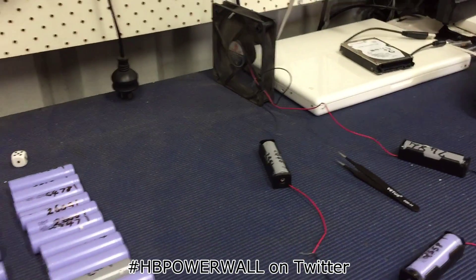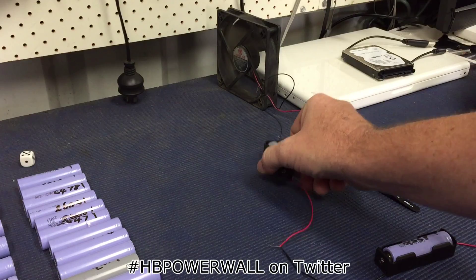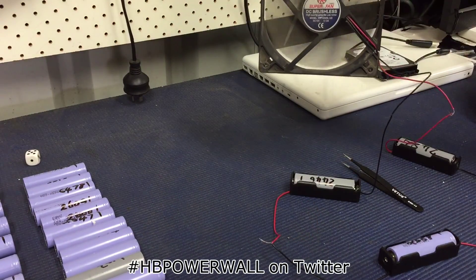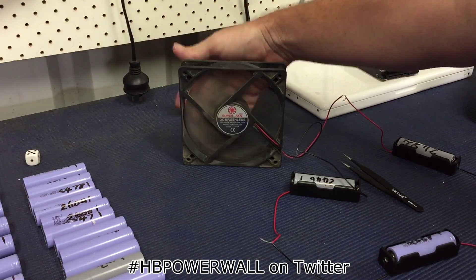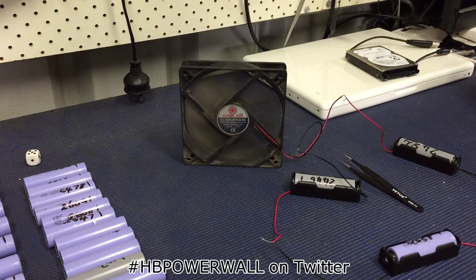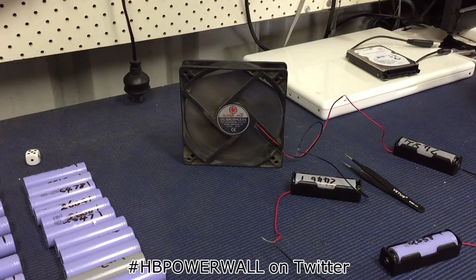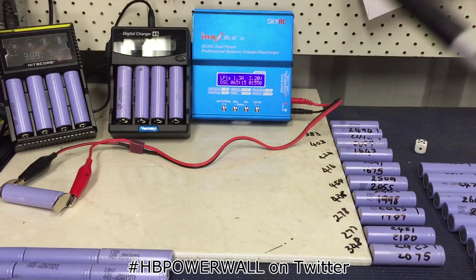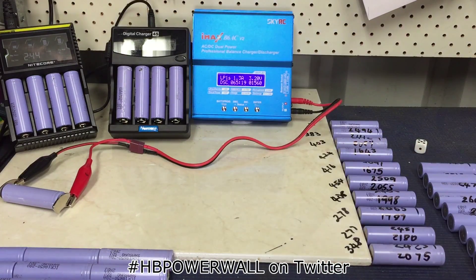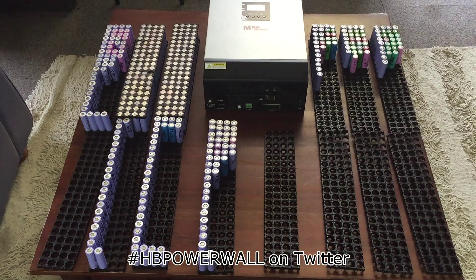The way I'm doing that is a bit redneck - I've got to keep all this stuff cool. What I've done is hooked up three batteries to make 12 volts and just whacked on a dodgy old computer fan. That has two benefits: one, it gets these batteries back down to the voltage I want, and I constantly check them with that. It's a bit labor-intensive but so far it's taken four hours and only taken half a volt out - discharging nice and slowly. And it keeps all this gear cool, so I can do three at a time.